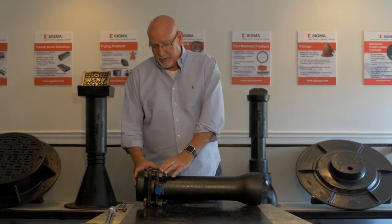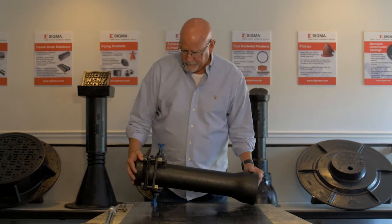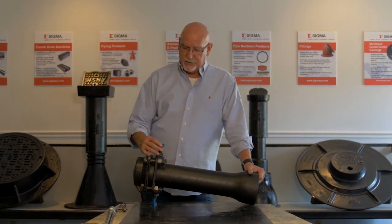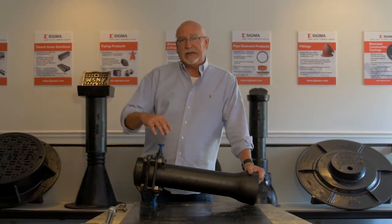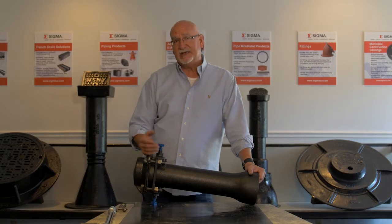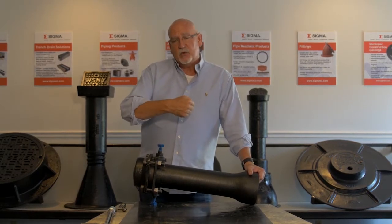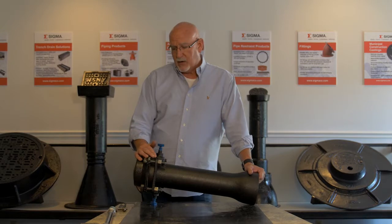The only difference between a restraint gland and a standard follower gland is the addition of a mechanical apparatus that's used to lock the gland to the pipe. It's actually teeth on an insert that's underneath this break-off bolt. The break-off bolt is used to engage the insert into the pipe. The insert actually doesn't finish engaging until the system is pressurized and there's an opportunity for the forces to actually cause the insert to wedge into position and lock for holding the pressure that it's designed to hold.